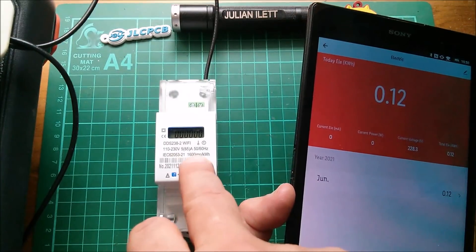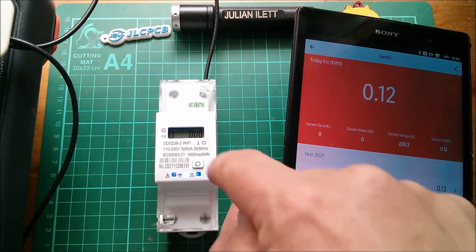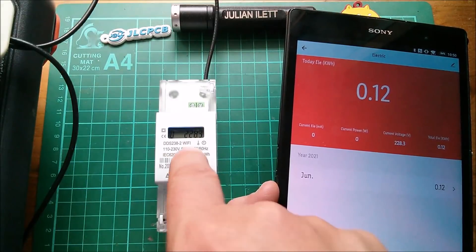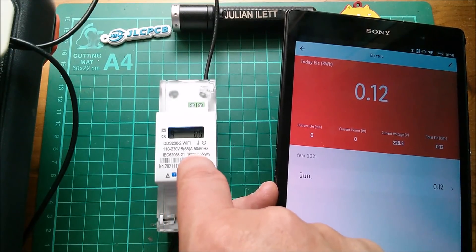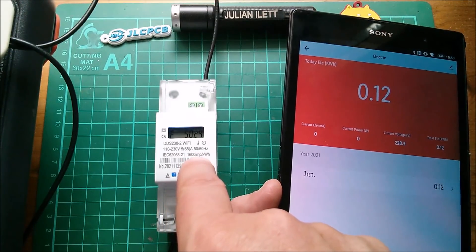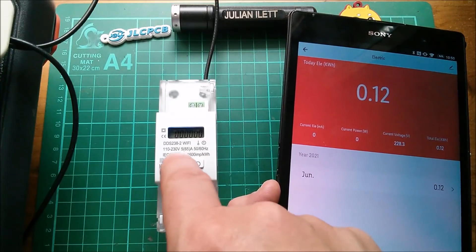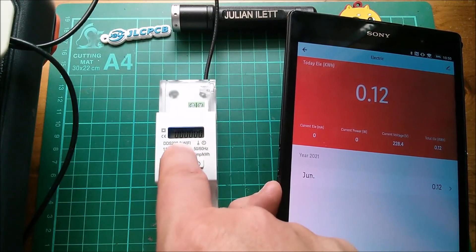What I can't see clearly here — there are two registers you can select with this button. You have to press and hold it for slightly longer. That's the pulsing indicator. So we've got: I, V, some display mode, power 0, Q, power factor 1.0, frequency 50.24 Hz. And I think one of those counter screens is the forward power counter and one is the reverse power counter.